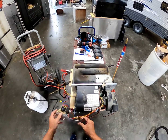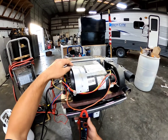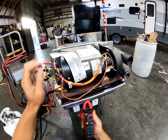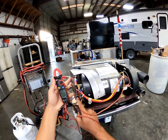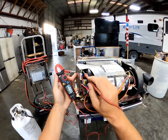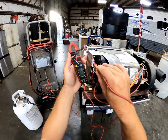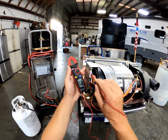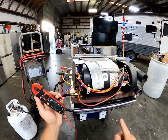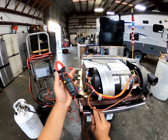The way I usually start out testing these is the most easiest, and that's from our board. These are a fully DC appliance, so you'll have to have your voltmeter set to DC. With our voltmeter set to DC, we'll go ahead and turn on. This furnace is not going to ignite — I have the propane off and the gas valve taken apart. So we know we have power coming in, the fan has come on. I know that this is my signal from the T-STAT, so I check here. I'm seeing 10.8 volts. I know that completing a circuit, it comes back on the red wire — I see my voltage on the red wire. If I see it in but I don't see it back, I'll need to trace that voltage back and see if my limit switch or my sail switch has malfunctioned.